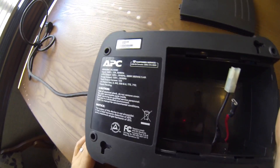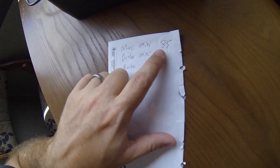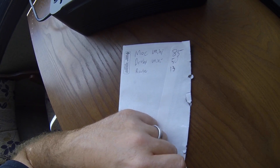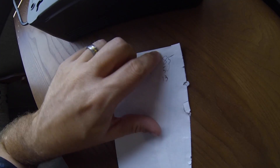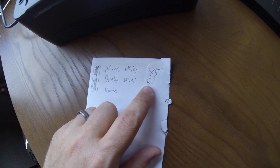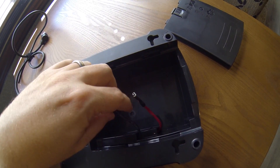I'm going to figure out how much power I actually need to use. 390 watts is the maximum this thing can put out — let's see what I'm going to actually use. I'm going to power three things off this unit. My Mac Mini is 85 watts, my Drobo Mini is 50 watts — it can actually run a little higher, somewhere between 50 and 200 watts, but I'll go with the lower end. My router is 13 watts. Total is about 160 watts. I'll guess it's probably somewhere under 200 watts. For 200 watts, that means I'm pulling less than 30 amps at 12 volts, which will run absolutely fine on a 12 gauge cable.